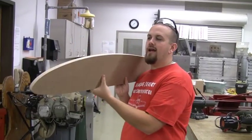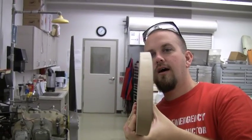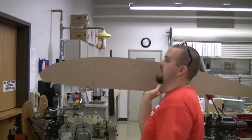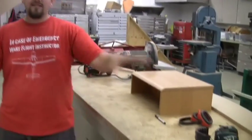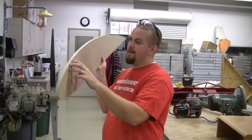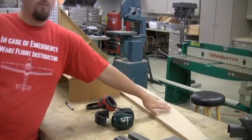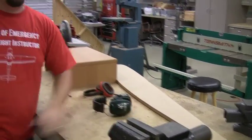So we finished sanding out that five-degree angle, which you might be able to see there. We finished sanding and we got our right wing, which flanges away from the piece correctly. However, what we didn't realize was we marked the same side for the left wing, which means if you sand it the other way, you actually need a line on the other side. So what we had to do — since we didn't flip the Mylar over, note to self, we'll do that next time — we traced around this one onto the back side of our second wing. Now we have it on this side and can use that to sand for the left wing.